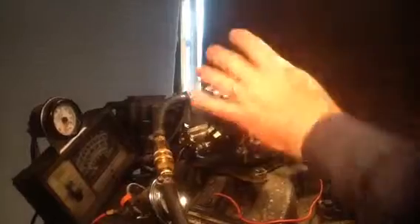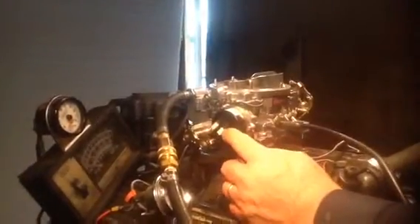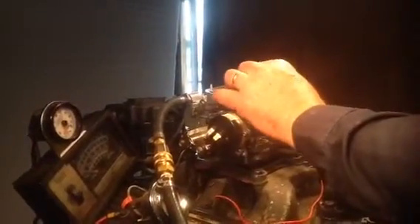You need to leave this thing turned off, just like it is, just like we'll ship it. Then when it gets 45 degrees or colder, you loosen up them three screws and turn that plastic until that blade touches like that. Then leave it alone. Put your wire up to it and you'll be ready to go.